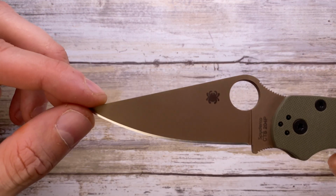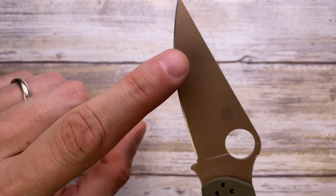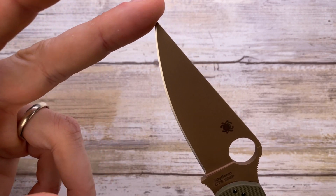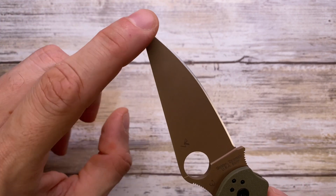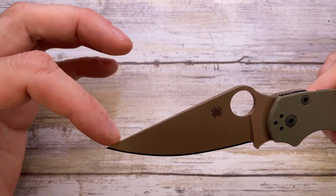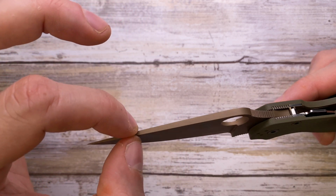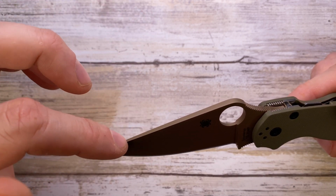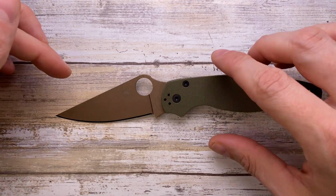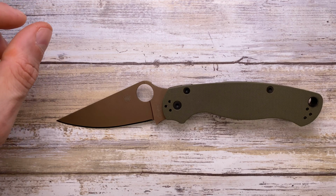And they went over the top, doing some pretty cool PVD coating, which is physical vapor deposition coating. They are coating this blade with a vacuum procedure, which produces a thin film that's going to wrap around this blade. It's really cool. The result is very interesting, very uniform, and it's going to add extra protection, of course.